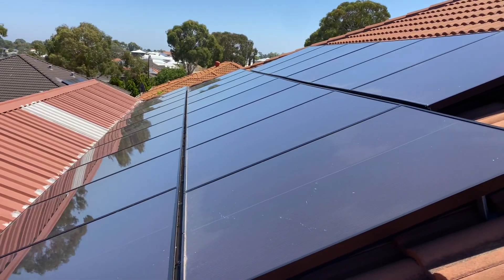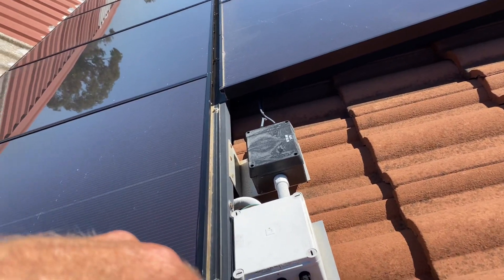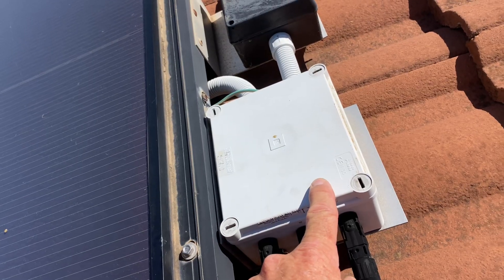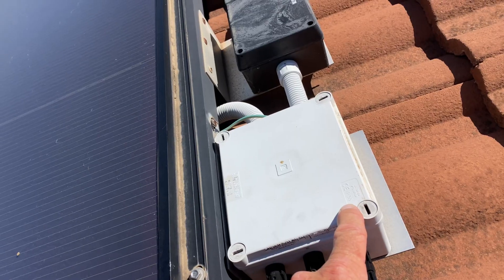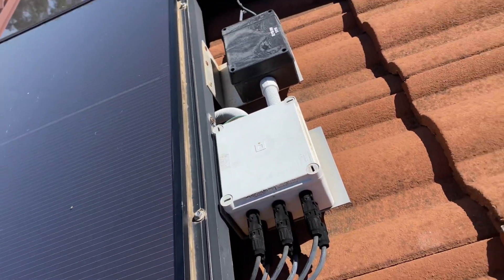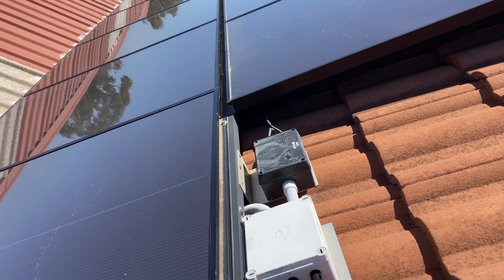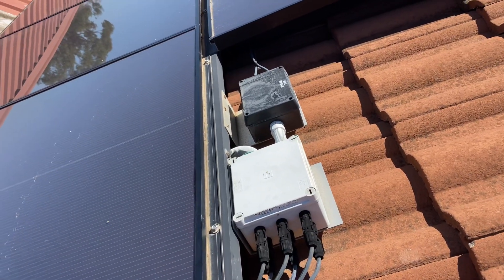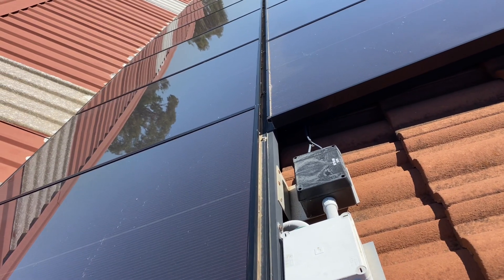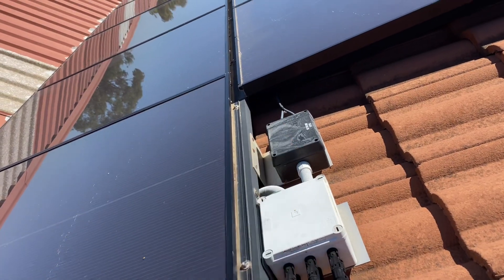It's an older system — I've done the fault finding, got it back up and running, and it's pretty much making full power again at four kilowatts. The fuses were hard to find, but I eventually found them at NHS Sales in Atlas Street, Welshpool — thanks to a colleague Glenn. They sell every single fuse you could think of, though they're quite expensive — about $15 each for these little HRC cartridge fuses. I've bumped the current rating up a little to six amp because I think it's the heat and possibly humidity causing them to blow when there's actually no fault.